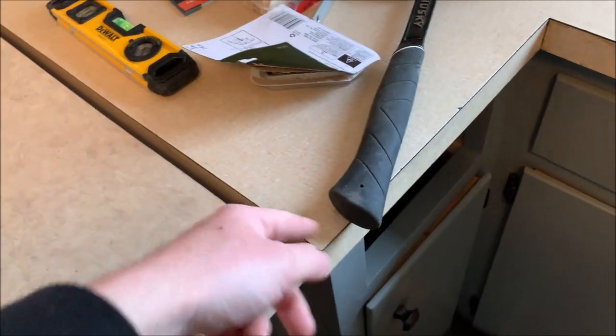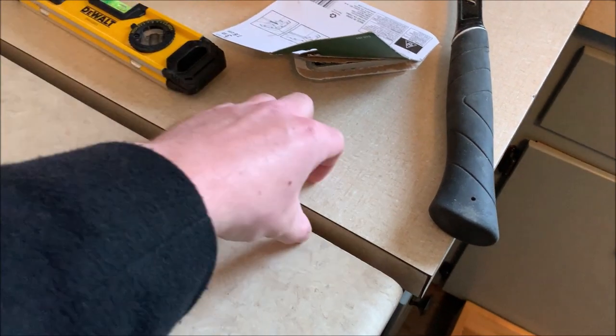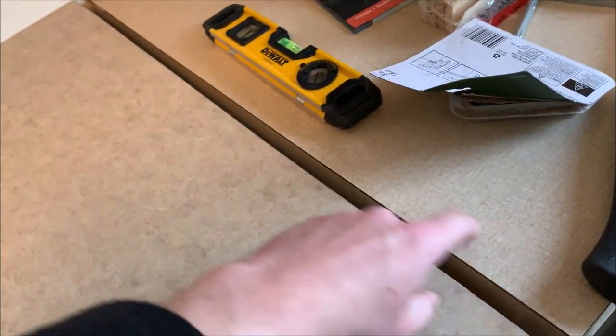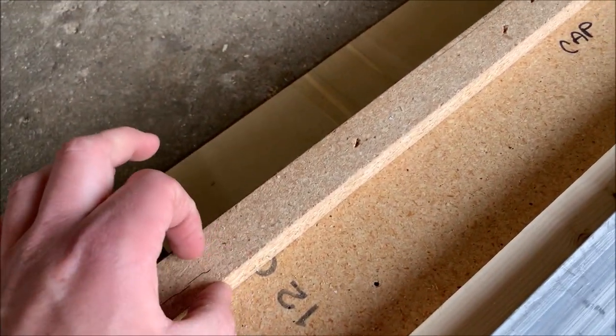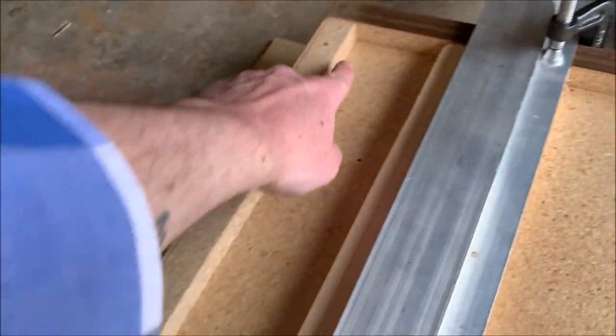All right, let's go to Home Depot. I got this aluminum molding in the shape of a T — it's made for tile. The plan was to run that across this gap, but it's just too big, just a hair. New plan: my next thought was a flat piece of metal across, but I really don't like that. So new plan — I'm going to come in and cut some of this material out so it'll still be tight, and I'm still going to put that T-mold in here to keep water out with some silicone. So I'm about to make a nervous cut.